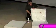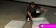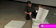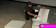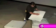We are now ready to install the topo panels. Remember, to prevent dust from accumulating, be sure to install the topo panels only after all other construction activity has been completed. After unpacking the topo panels and prior to installation, spray and wipe each panel with the provided anti-static spray and lint-free towel. Install panels surrounding utility circles first. These panels have a curved notch in one corner.